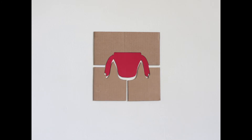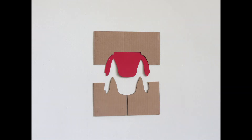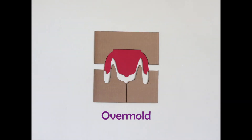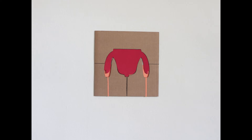Then the robot removes the bottom half of the mold and replaces it with the next mold, which will finish the handles. We call this an over-mold because it goes over the first molded piece. Once again, hot liquid plastic is shot at a high pressure, this time through gates on the handles of the cup.